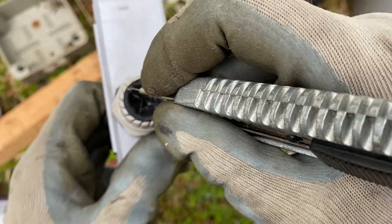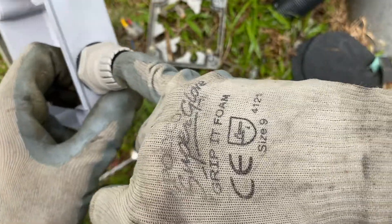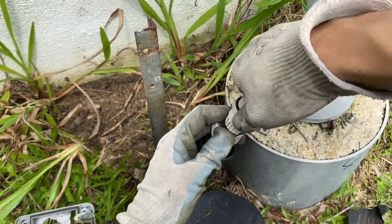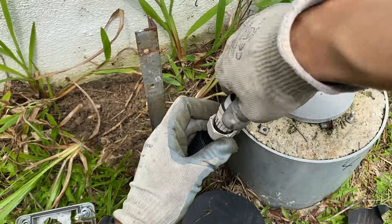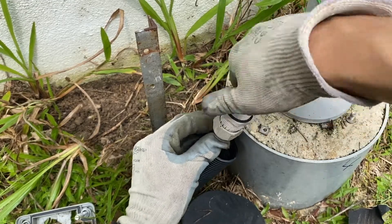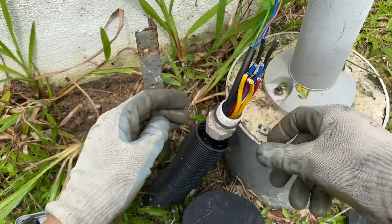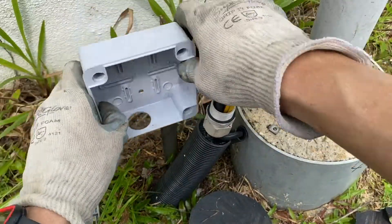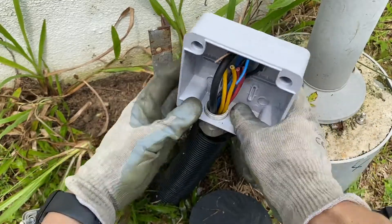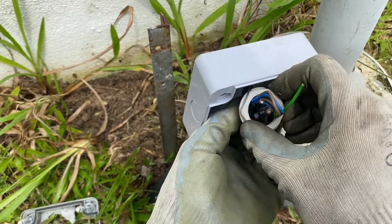Then I'm going to make an entrance through the cable gland, drawing across one and two so the wire can be fit through this hole. I find it easier if I install the cable gland onto the cable first — feed it through all the way down through the armor cable, then tighten the screw, and then install the junction box. I just need to fit the wire into the junction box, turn it clockwise, then follow with the nut to secure the cable gland together with the junction box.